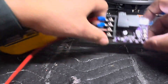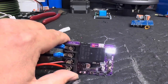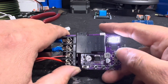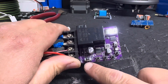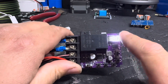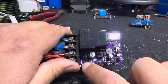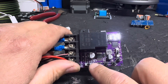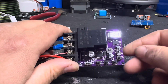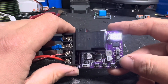We're using it for a DeWalt battery setup right now. This battery is almost dead, showing 18 volts. We have automatic and manual mode. In automatic mode, when the voltage hits the set point, after 60 seconds the load will cut out and it won't draw any more power. In manual mode, as soon as it hits that set point it'll die. You have your reset button here for when it does die and you put a new battery in — sometimes you'll have to hit that.